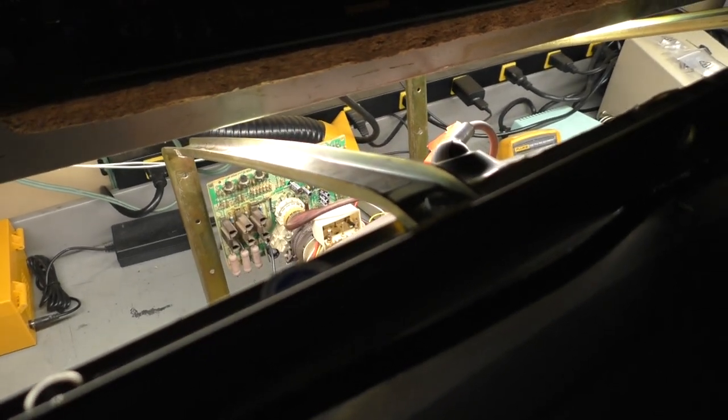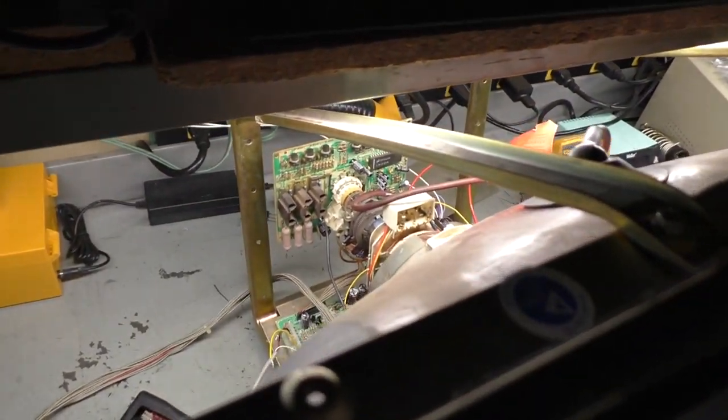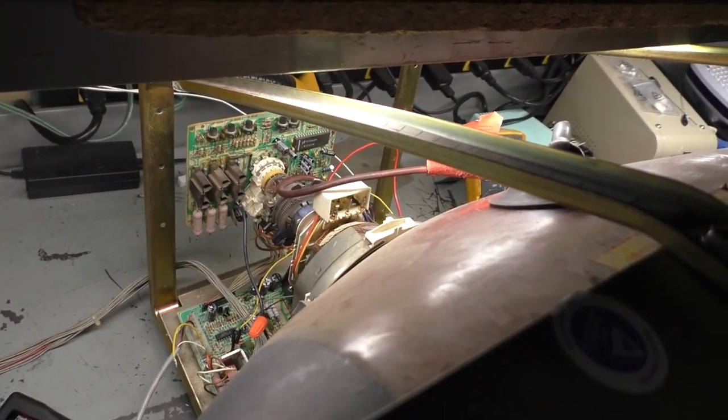The chassis is now repaired, but how come I keep having color problems? Is it just a dirty pot? Is it just that easy? Let me grab my driver here. We'll try the blue again. No, it's not a dirty pot. Somehow we lost blue again. Gosh dang it. Well, let me try and troubleshoot again here, see if I can get the blue back, and then if I can, we'll call this a success. I'll do the burn-in test and get this back to the owner.